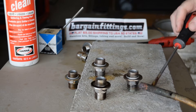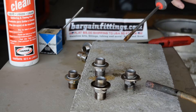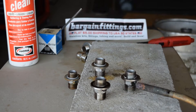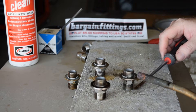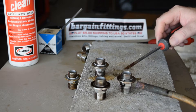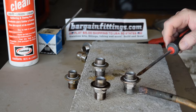Watch as it just starts to melt in when I move ahead of it. Sometimes if you notice it's not wicking in, you can just touch it with a little flux and come back. You'll find that sometimes that's enough to get it to wick into the fitting. On occasion you will get the odd fitting that doesn't cooperate.